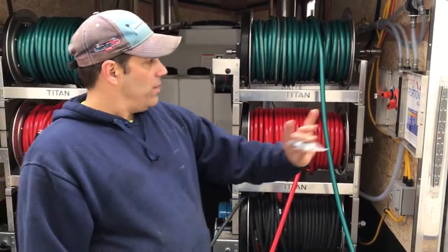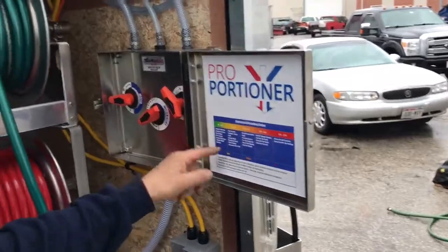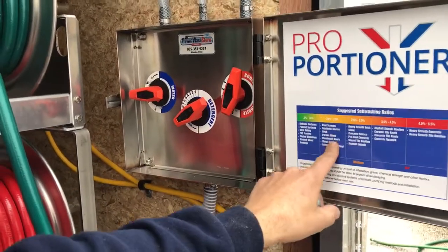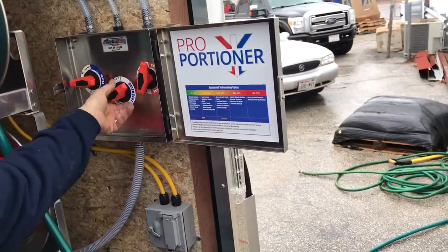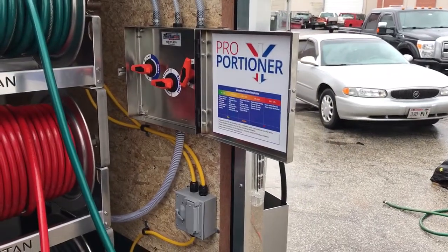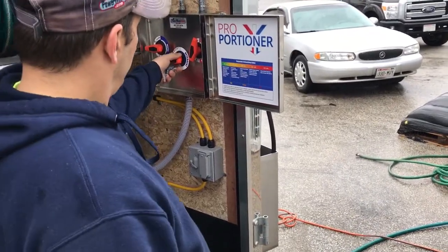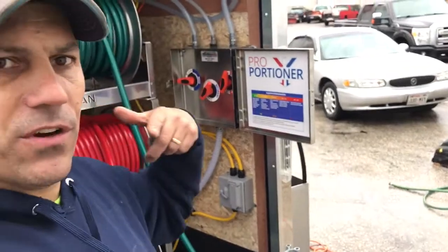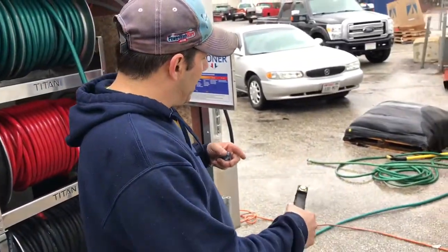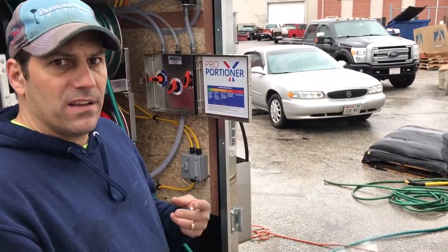So what I'm going to do now is change my mix. I'm going to come back down here — I don't want to do heavy growth, I want to wash the house now. So I'm going to take the proportioner, turn this valve back down to 2%. I want a 2% mix for cleaning some pool screens. I'm going to take my detergent and turn it up all the way, start the booster pump up, squeeze the trigger, and count to three: 1001, 1002, 1003. Now I'm going to turn my detergent back where it was and just continue to spray. What you'll see is a big glob of soap, and when you see that big glob of soap you know everything after that is going to be the new mix.